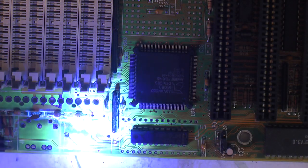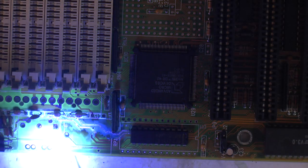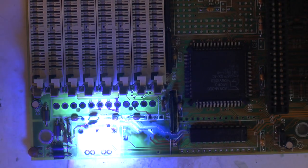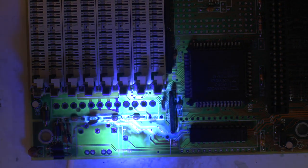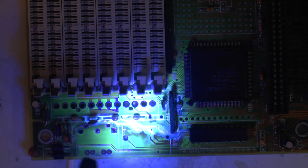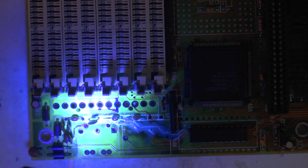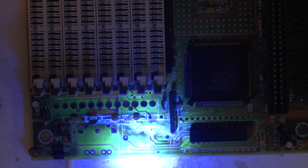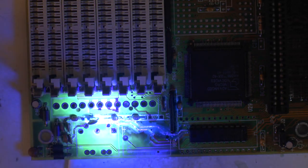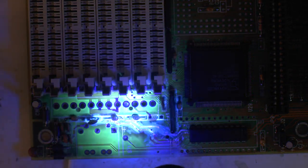So yeah, it hardens, and it's like silicone now, so you have to be careful with it for a while. But as time goes by, like I said, it gets harder. You can get it to look almost like transparent ice or water when it's done, with a real hard finish. So this is not gonna corrode, the trace is gonna stay there now, and if the trace is slightly loose, it will stick, so you can do trace repair, like a wire and coating in this, and it will stay there. So this is nice like that.